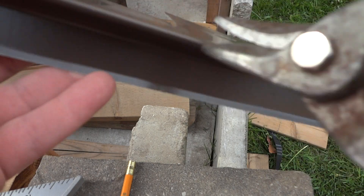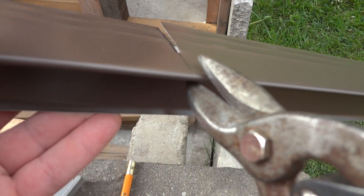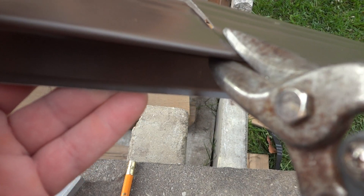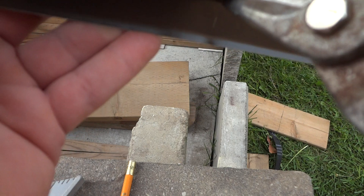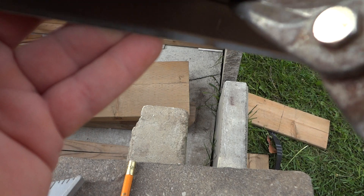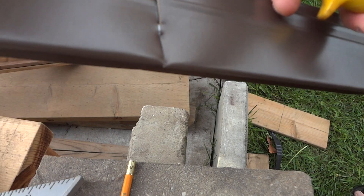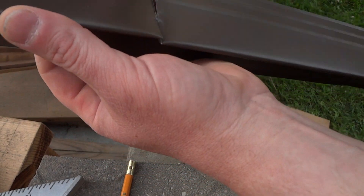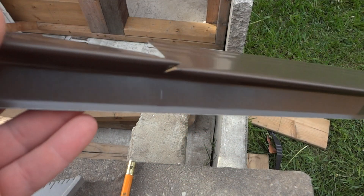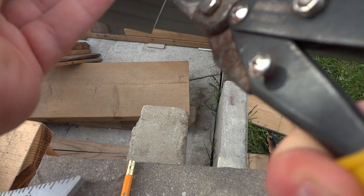You can just cut from this side — it's going to bend it a bit. If you want a better, more accurate cut, use an angle grinder or a chop saw with a grinding disc, but I don't think that's necessary. You get a pretty good cut here. If you draw a line with your square it'll be square, and you can also use the factory edge.